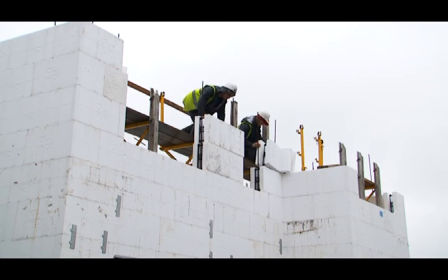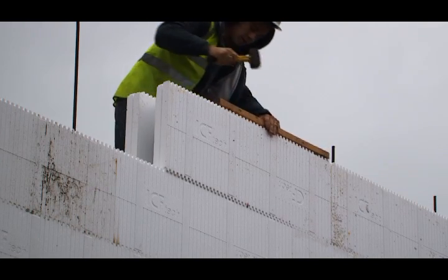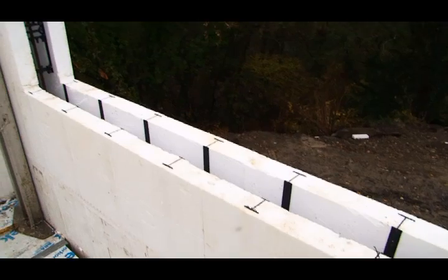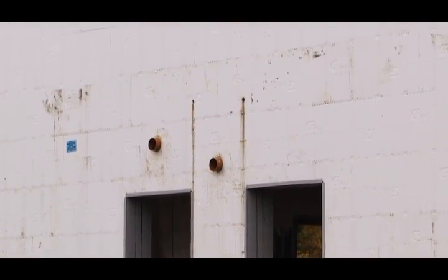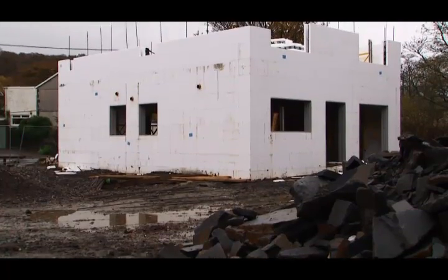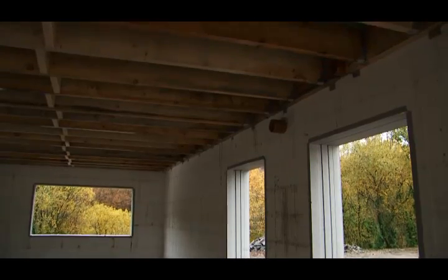The placement of ICFs for each consecutive story is then simply a repeat of the process of that of the basement, using the same bracing system and allowing openings for windows and doorways to be pre-formed using our specially developed profile. Any service penetrations that are needed are also formed at this point, usually with polypipe, before the next concrete pour completes this story. From foundation slab to first floor would typically take approximately 1 week, including the concrete pour.